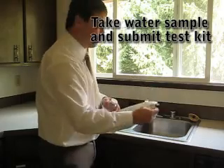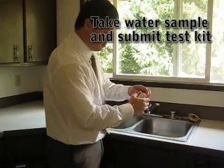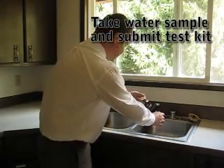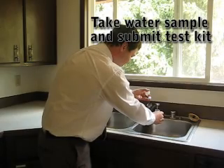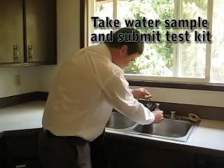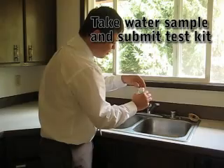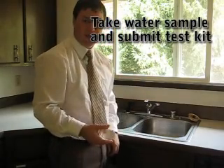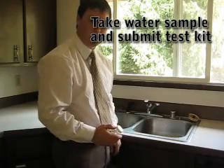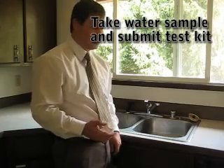I like to use Avocet. They're a local company. It's only $18 to test a well, which is pretty cheap. So you're going to want to pop the seal off of that. Make sure you don't touch anything or dump out the little stuff that's in there. You're going to want to fill it up using an interior tap just over that line that they've got there. Seal it up. Avoid excessive temperature and within 24 hours, I'm going to go right now and drop it off at Avocet and we're all done. Within 24 hours, probably tomorrow, they'll give us the results and hopefully this one will be clean.